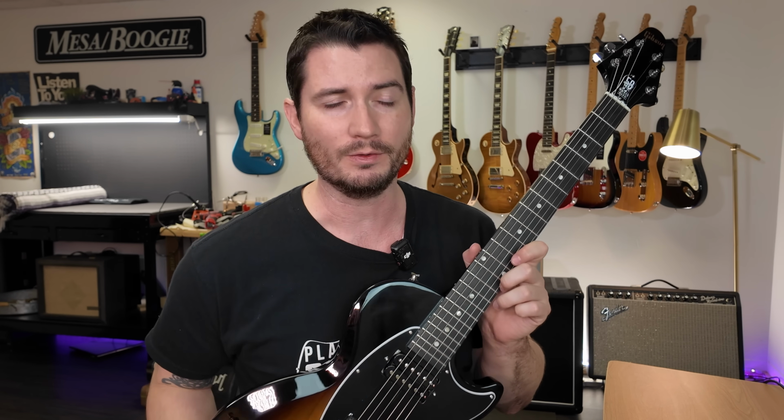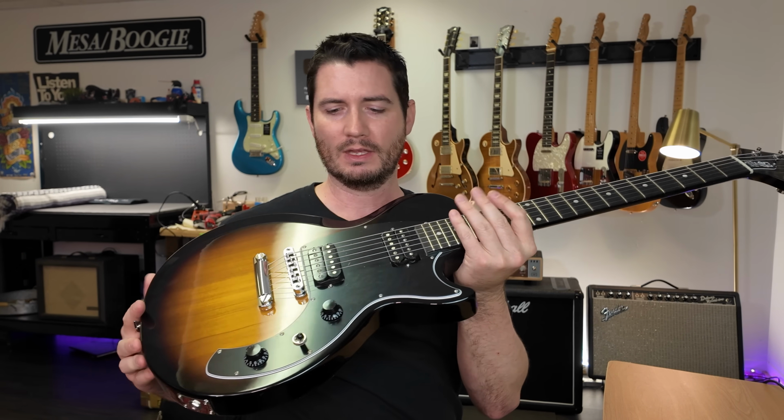Now when it comes to sound, I'm gonna have to go back and check the tapes, so to speak. I found these pickups to be a little bit muddy. And what's going on here is when I read them with a multimeter, they are reading very hot.